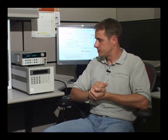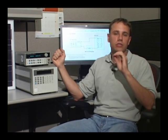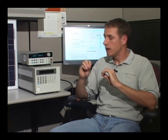One of the great advantages to using a DC electronic load for PV testing is its high power handling capability at a fairly low cost compared to four-quadrant power supply type devices. The other great thing about a DC electronic load is it has built-in voltage and current measurements, so you don't need an outside instrument to monitor them. The Agilent N3301A has current and voltage measurement capabilities built in, in parallel, so it can measure voltage and current simultaneously.